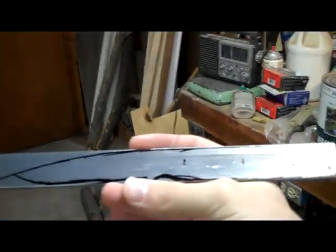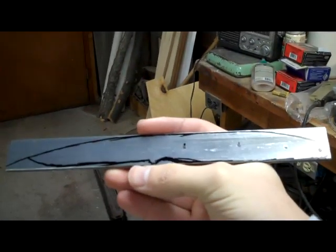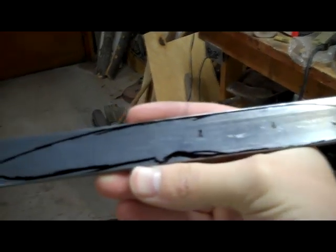What's going on YouTube? It's Knife Making Wednesday and today we're gonna be making a knife from scratch. What we've got here is a blank of steel, about a quarter of an inch thick, about one inch wide and about nine inches long. I've drawn my pattern with a sharpie on here that I'm gonna grind out for my knife, where I'm gonna drill my holes for my rivets, and we're gonna put a wood handle on it, glue it all together, sharpen it up, fire it, temper it, dump it in some water to make it hard, and we should have a knife when we get done.